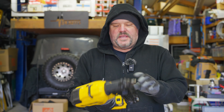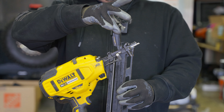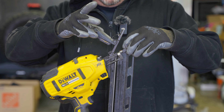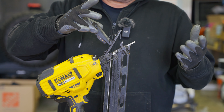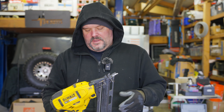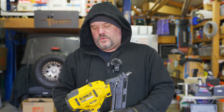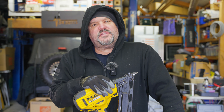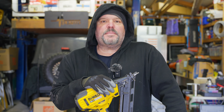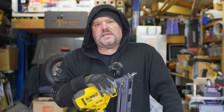It's also easy to clear a jam. If you have a head jam, you just pull up on this nosing like this and pull this back, and then you can clear the nails or push the driver back if it gets stuck — those things happen all the time, but jams are easy to clear. I've never had a problem with mine. Leave me a comment below and let me know if you have one and what you think of this gun. I really like it. If you like this revisit, don't forget to hit that subscribe button and the bell icon, leave a comment, and like this video. Thanks for watching — have a great day.